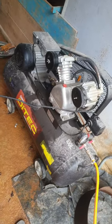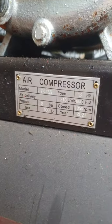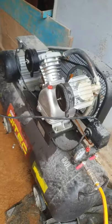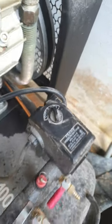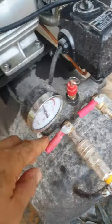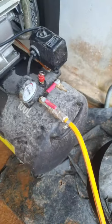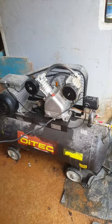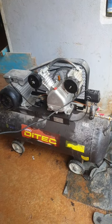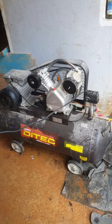Before we use the Kouturi pneumatic hammer, there is a compressor. I got this compressor here which is powerful enough — here is the description. We switch it on automatic so it will refill itself each time there's no more pressure inside. Here are the valves. If I open a valve, you can see there is already air inside. That pipe here is the air pressure pipe going to the tool, and it already has a valve which stops the air from going out whenever the tool is disconnected.